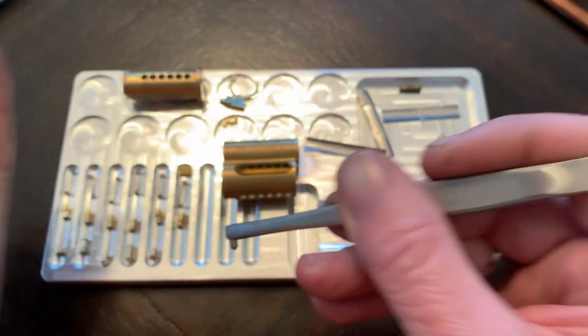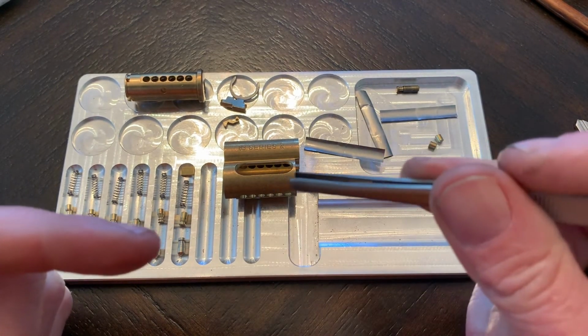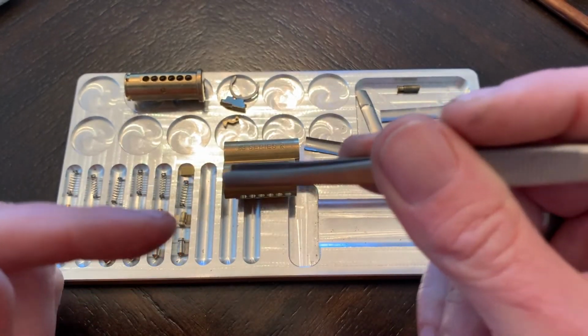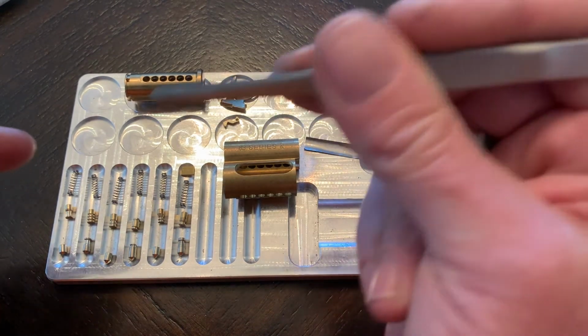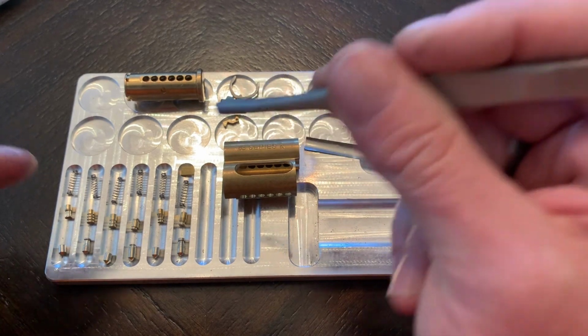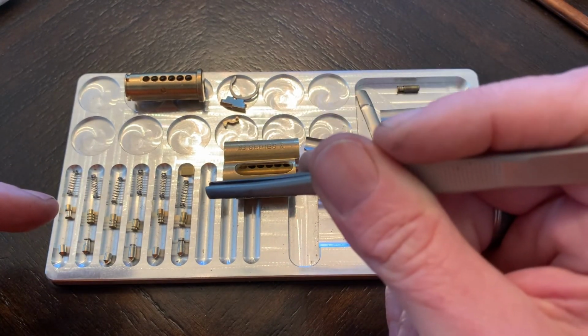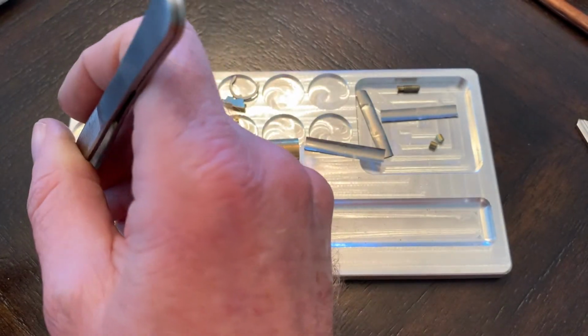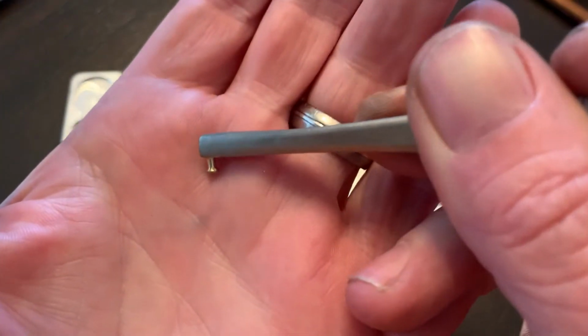And what you do is you do nickel silver bottom pins with a nickel silver key. They wear less. If you use a brass key on nickel silver pins, it actually wears the nickel silver pins faster, and vice versa. If you use brass pins with a nickel silver key, the nickel silver key wears faster. It's that odd combination of the two metals rubbing against each other.